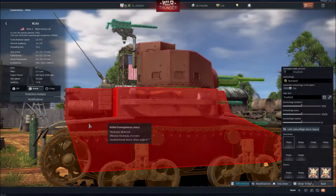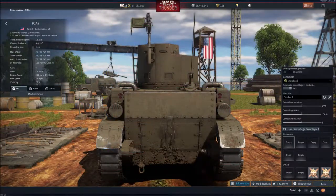Moving down, the hull slopes inwards at 18 degrees. Not only does this cut down on size and weight, it also encourages the air blown through the engine by the cooling fan to flow upwards and out through the rear vent. In this panel are two large engine access doors for performing maintenance. To remove the engine entirely, however, the engine deck would need to be removed. And finally, at the bottom, there are two more towing loops.